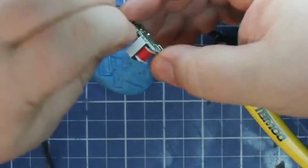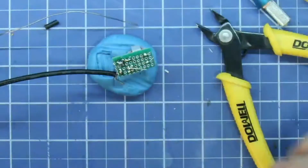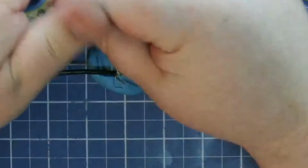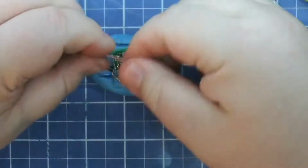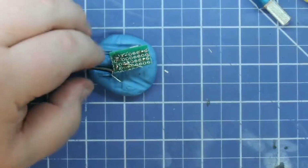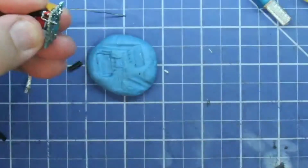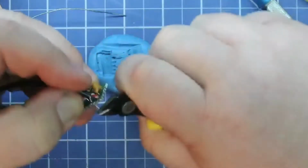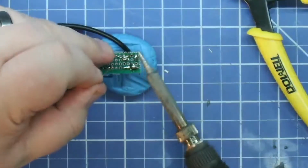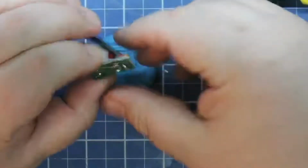And what I did is I have shielded 2-wire and 2-conductor cable, but in this case, since it's the balanced side of the rig, just to be safe, and just because, hey, it's there, I went ahead and just twisted the red and white wires together to make just one cable. Because with RF, I just wanted to be safe. Unfortunately, the hole I wanted to put the ground in kind of got filled with solder, so I had to go wick that out. So that's what that little wire is there. It's just to connect the ground from the other cable that I don't have hooked up yet.